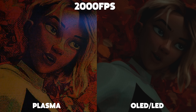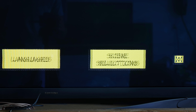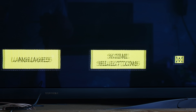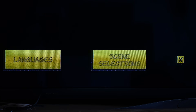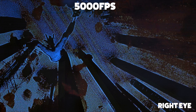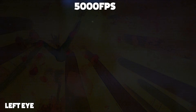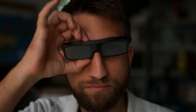The way this differs from an OLED or an LCD TV is that in slow motion, you can't actually see the entire frame at once. So now if we switch to 3D mode, to the human eye without glasses on, it looks like both perspectives are just blurred over each other. However, if I turn up my shutter speed on this camera, removing a lot of the motion blur, they're not just stationary sat over each other — it's flicking back and forth very quickly. So we now know that once the TV has completed building out one frame, it then switches perspective to the other eye and builds the same frame from that perspective.